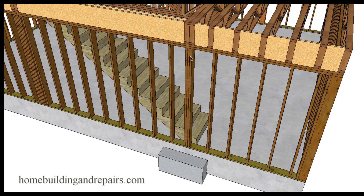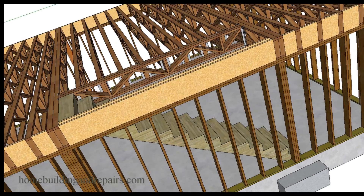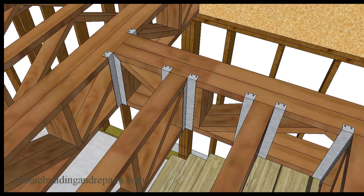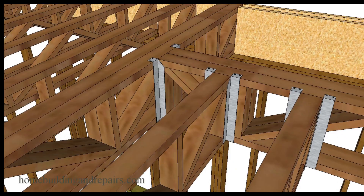There's a tripler underneath here — two, three, 2x6s. You might need a 4x6 or a 6x6 for something like this. Here's the footing: you might need a larger footing to support this because it's going to be a concentrated load now, not equally distributed throughout the standard footing. Top flange hangers are used for situations like this, and another top flange hanger to support this. As mentioned earlier, you might actually be able to do all this with conventionally framed lumber, glulam beams, and then just use the floor trusses for the other section.